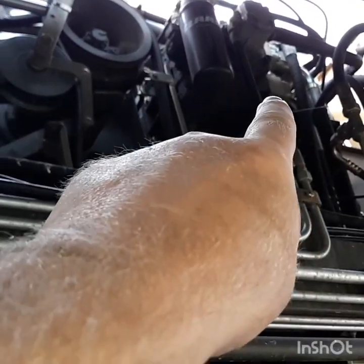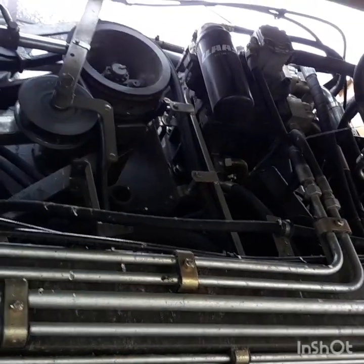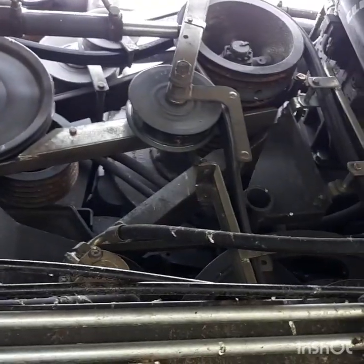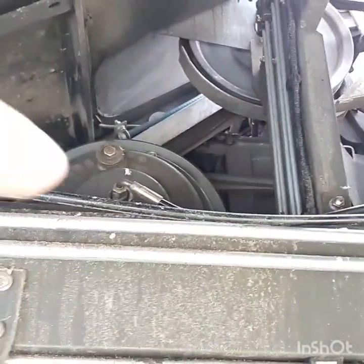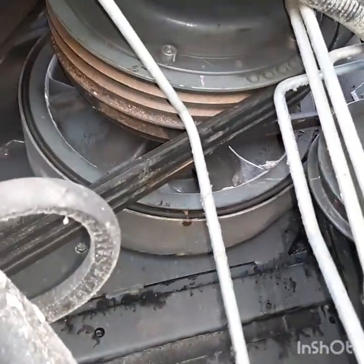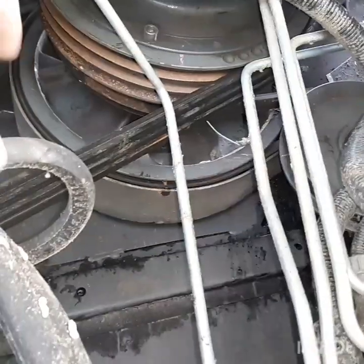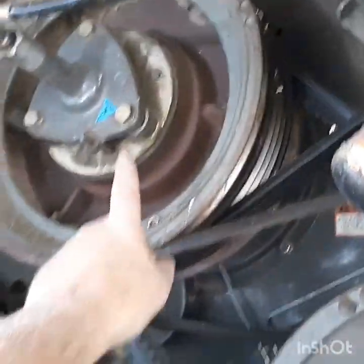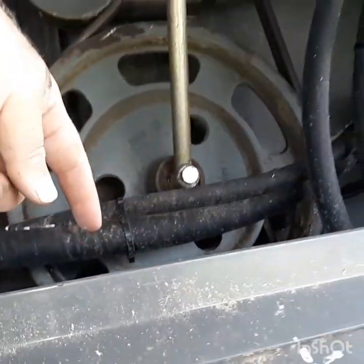Starting up at the engine gear case, you've got your hydraulic bank to the right. As far as power out to the combine, the furthest inside belt is that big multi-rib belt coming down to that pulley — this shaft is our primary cross shaft with our feeder house clutch, and it gets power to the other side of the combine. That feeder house clutch can engage power to our variable speed, which then runs power forward up to the feeder house. It also runs a belt back to that bigger pulley and then down pulleys and belts to run our clean grain, tailings, and shoe.